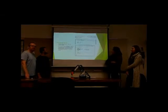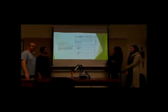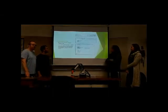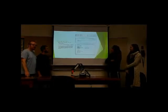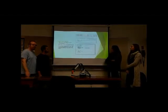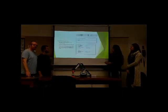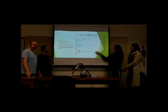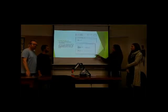The code for our robotic arm is relatively short. It uses the servo library and the stepper motor library, which incorporates the acceleration of the stepper motors and the steps used to control the servo motors. All we had to do was take the analog reads from the inputs and use them within a conditional statement, having the stepper motors rotate whenever there was analog input from the joysticks. For the claw switch input, we used a two-case format — one case for opening the claw and the other for closing it.